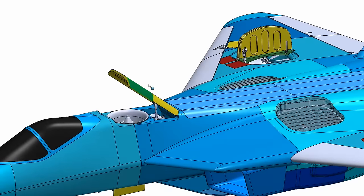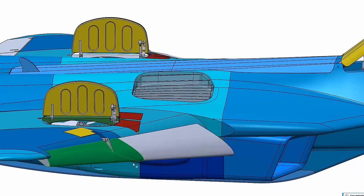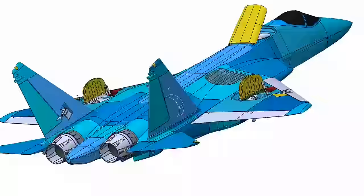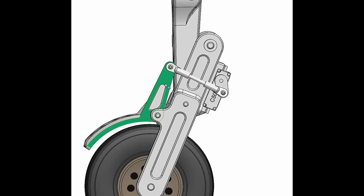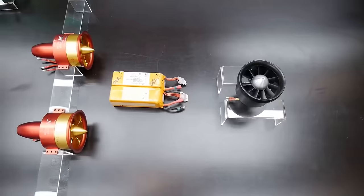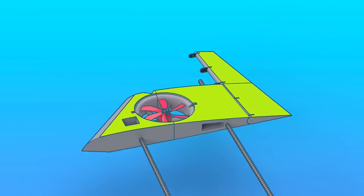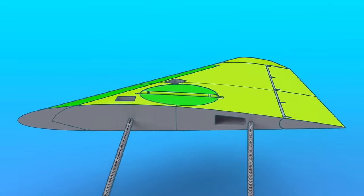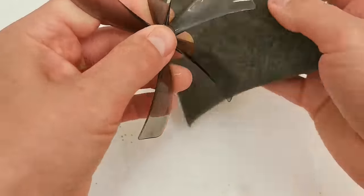Technical details like the main lift fan cover or the droop nose, even the wing covers, will transfer to the JRM, but with a lot of improvement for longer hovering time. Also, the composite technique has to be transferred to the 3D print technique. So at first the complete propulsion system, main EDF and lift fans, were tested to reach maximum efficiency and also power, to see if 100% longer hover time will be possible, and this means a minimum 5 minute hover time.